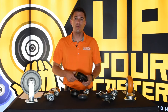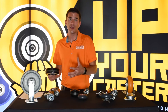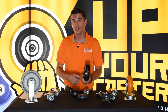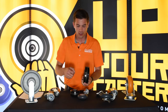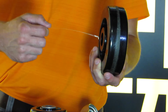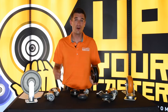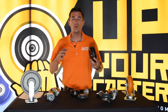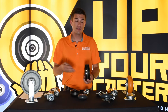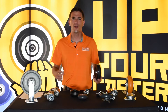The next thing we'll talk about is hub length of a wheel. This is something that you probably won't have to measure very often, but sometimes it is important when you're keeping a fork on an application and just replacing the wheel itself. To measure the hub length, it's kind of the same thing as tread width, but it's usually a little bit longer than that depending on your wheel application. This is a phenolic, just like last time, and you put your tape measure on the inside and measure one side to the other. This, for instance, is 2-3 sixteenths. Your measurements on hub length are going to be way less of a normal number than wheel diameter. A 6-inch wheel in this case has a 2-3 sixteenths hub length — it's kind of a weird measurement, so if you get one of those weird numbers, don't worry, you're usually going to be right.